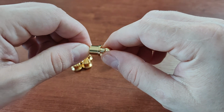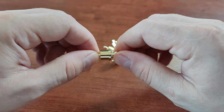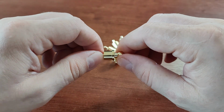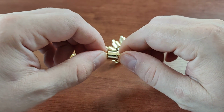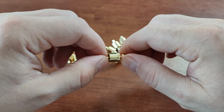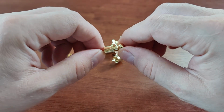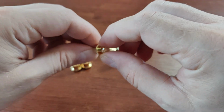When you short unused inputs to the ground, you make sure this way that there is no stray signal, no EMI interference, nothing like that entering the signal path with the input, and it actually sounds better. Again, the effect is minuscule, but on highly transparent systems, and my system is unfortunately highly transparent, unfortunately because it always hurts my wallet, because I can hear every change of cable, wire, everything. I'm using Martin Logan electrostatic speakers with two monoblock power amplifiers. So these are very transparent, and I can actually hear that blocking RCA inputs with these gives some small effect.